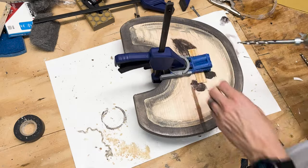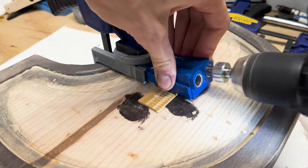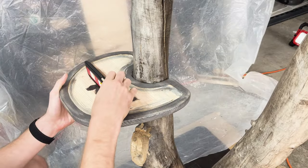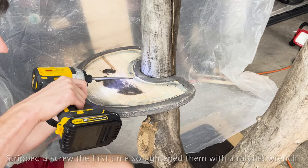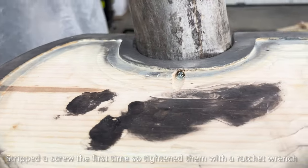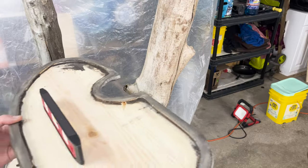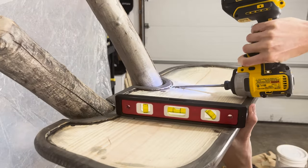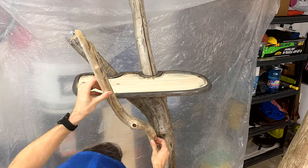For attaching the shelves, I want them to look as natural as possible, so I'm going to put each of them on the tree using pocket holes and screws. This alone obviously won't be enough to hold up our fat cat though, so I'll use some extra pieces of driftwood as additional support and hopefully they'll just look like branches. I have a personal goal to reach 4,000 subscribers on this channel by the end of the year—if you find builds like this interesting, I'd really appreciate it if you subscribed.